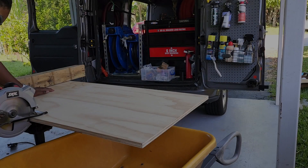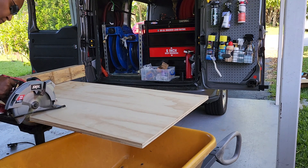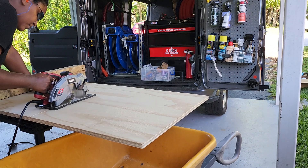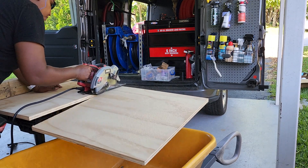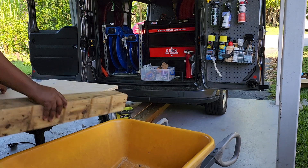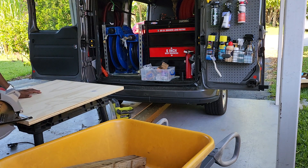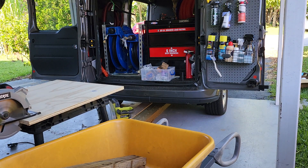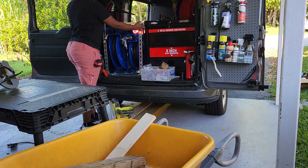And there is the vacuum reel. I used three quarter inch plywood. I was getting some jagged edges cutting before, and I found out online that you should just cut very slowly — this footage is actually sped up 400%. One side is a little bit over 24 inches so I had to use the longer side for that. Cutting slowly was the big takeaway there.